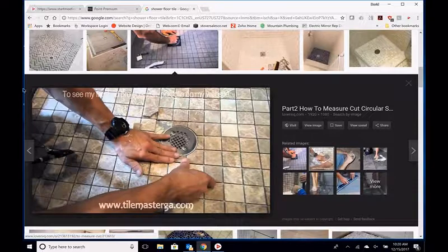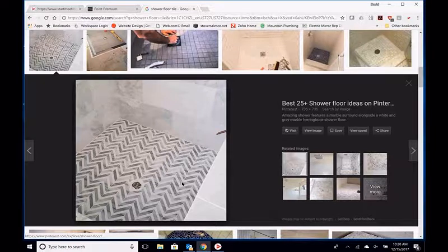So you've seen designers coming up with creative ways to change, if you look at some of these photos that are here. You see how this tile is on the wall and everywhere else on the floor, but we can't put that in the shower because we can't bend the tile. So what we would have to do is change this to a different style, size. What most people in the tile business will tell you, too, is trying to find a 4 or 6 inch tile that matches this tile is almost impossible. That's why you see contrast here and you don't see the same thing on the floor, because they don't exist. So designers have had to come up with different creative ways to do that. So the best way to do that is to use a linear drain, then everything slopes one way.